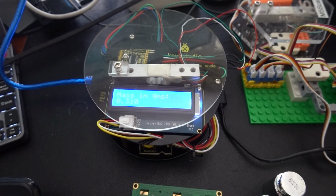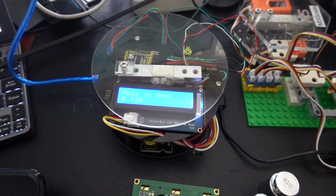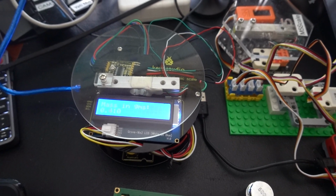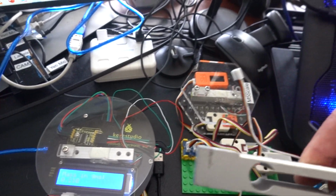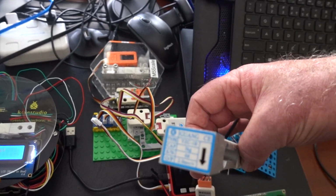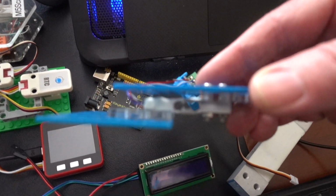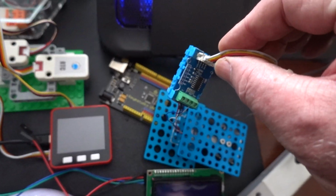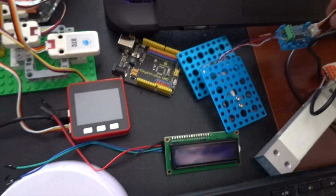But eventually I got it to work, and there are generic drivers and example libraries available for the HX711 weight unit, which is quite popular. And you can get the load cells in various sizes. So here's a really big one. Yet there's only 3 kilograms maximum weight, which is quite strange compared to the 5 kilograms one, which is much smaller. And here's another one I'm building, a very, very small one, which uses the Keyestudio HX711 amplifier ADC weight unit.